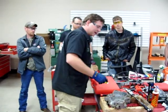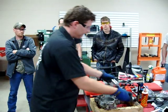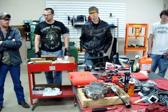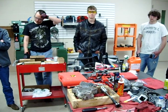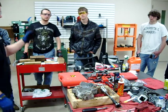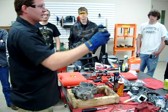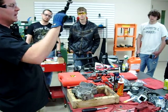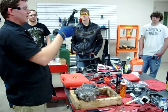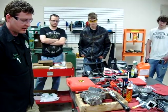And if anything, you think about what you're gaining — you're also gaining a little slide hammer too. You'll see some different tools that I've made over the years. One of my favorites: I took and welded a couple of nuts on a pair of vice grips, and then I can vice grip something and slide hammer it off. The bolt I welded on there is the same size as my slide hammer, so I can thread the vice grip into it and slide hammer something off. There's a couple of options, and that's how you do it without hurting anything.